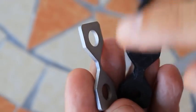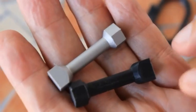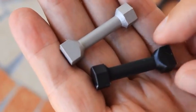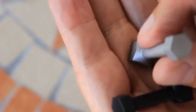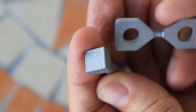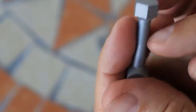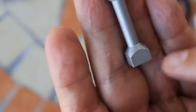I have no idea how strong the 3D printed metal is and I want to be able to break it with my equipment. However, I noticed that this torque test object is normally printed horizontally with FDM, but this metal part is printed in vertical position — I can see that from the surface texture. This means I will have at least one object where I test layer adhesion, because if printed vertically and if there's any weaker layer adhesion, it will break much more easily there.